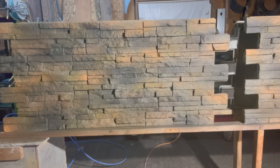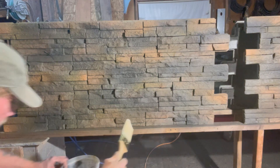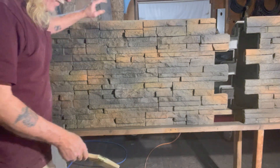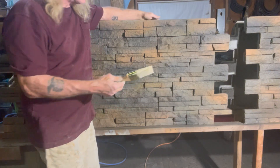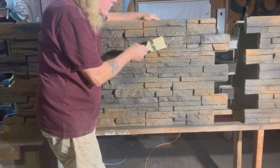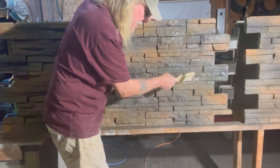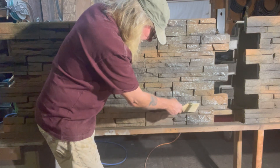I've got a tan mixed three-to-one and this is what we call a skim, where you take a brush and go parallel to the surface — you lay it and skim across, hitting the highs and accentuating them while placing another color. I usually throw out the color and the first touch is very light because the brush has the most moisture it's ever going to have. As you go you use more and more pressure because you're running out of liquid, then reload the brush. You can see it hitting the highs. Sometimes a two-inch brush works better on this stone than a three-inch, but it can still be done.